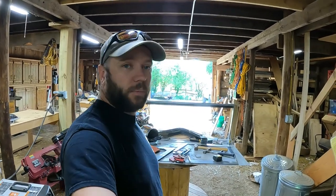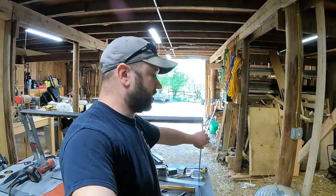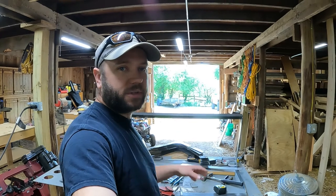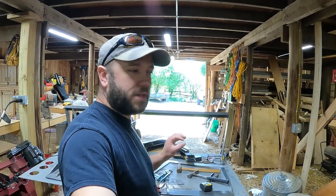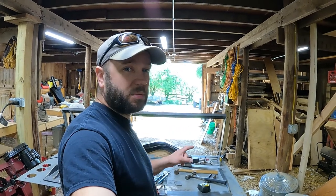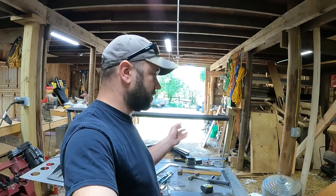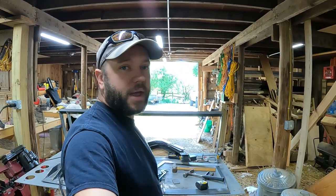I know I left off, we were gonna have to take this one out, the slat out here, and compare all the slats and make sure they're all the same size, because I did not make a jig and hold them all equal when I first made them, which I probably should have done. Paying for it now, I'm gonna have to cut some of these open and re-weld them together to try to get them all at the same angle.